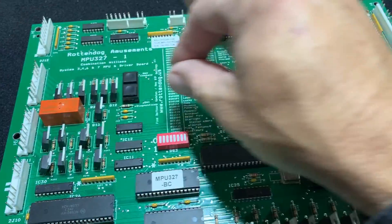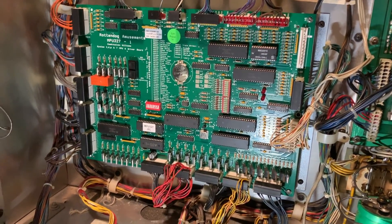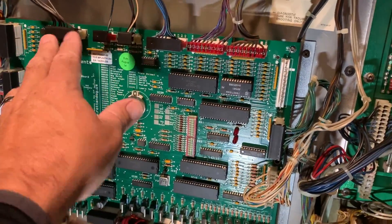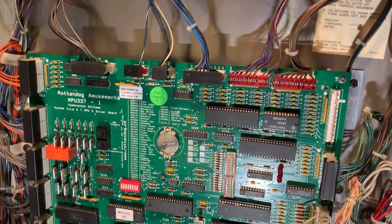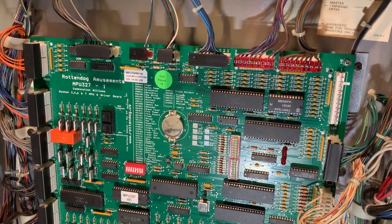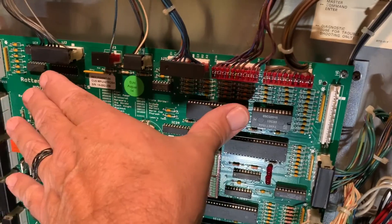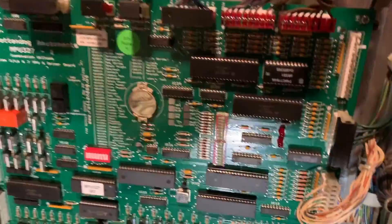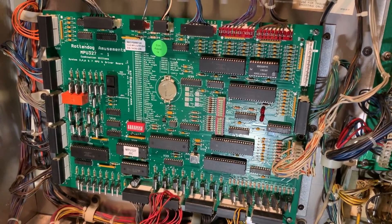I have the repaired board back in Blackout. I verified all the wires are in the proper positions — I really don't see how the J2 and J6 connectors could have been swapped, given how the wires are routed. I put a Sharpie dot on there so if I ever pull it apart I'll know to verify everything's good. Make sure that center brace is removed if you ever use this board. I'm using just the four corner mounting points and bending those center bracket tabs backwards so there's absolutely no chance of grounding any pins.